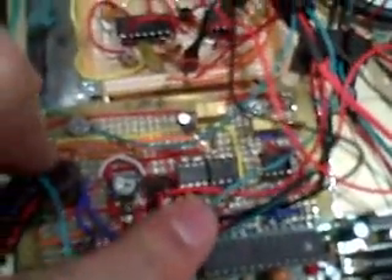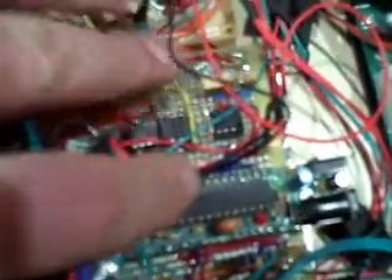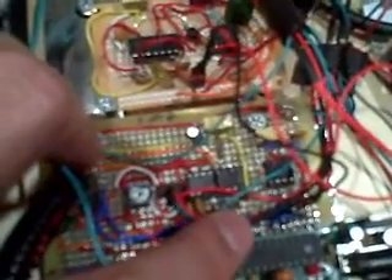The Arduino or Boarduino is connected to three chips. The first chip on the right is a TLV5618 DAC chip — it's a 12-bit DAC that creates the waveforms that drive the mirror. It's then fed through a standard op-amp, the TL082, which you can get from RadioShack. The final chip is a balanced line driver, which creates a differential output that is fed back into the galvanometer to move the mirror.